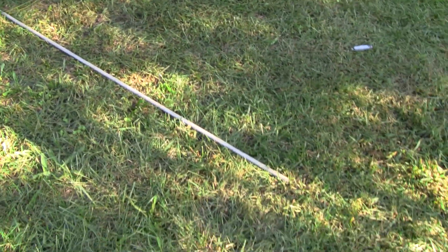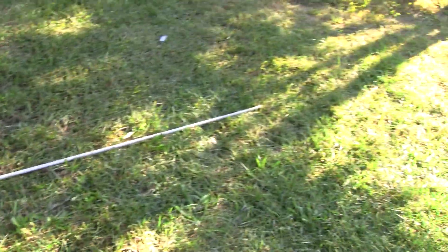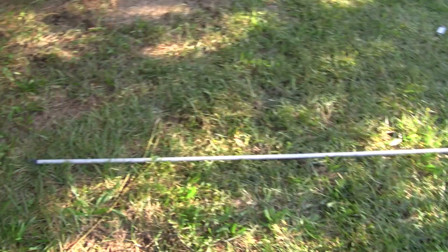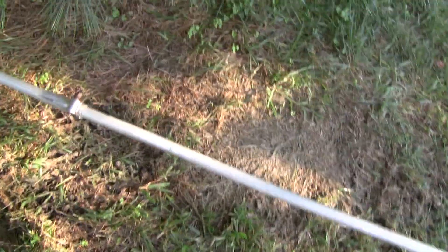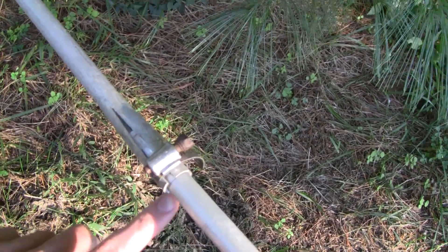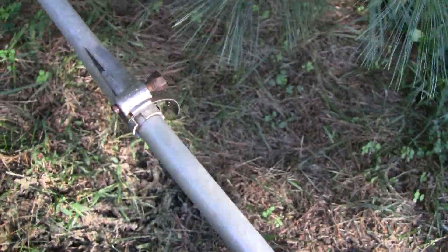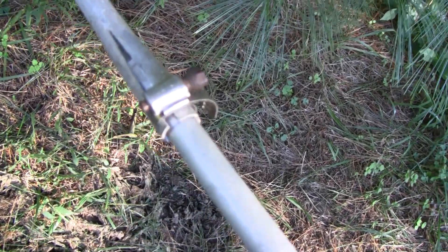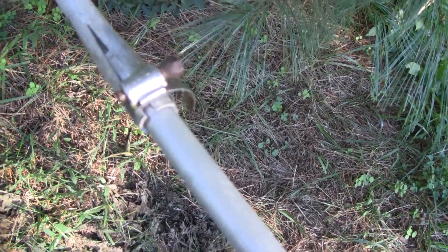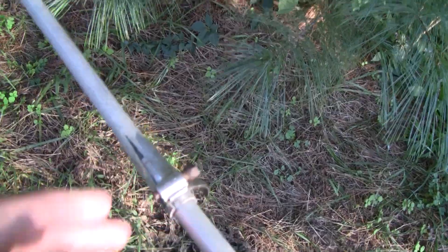The other element is half-inch aluminum tubing — I've got a spare piece here. They're about six and a half feet long to start with; I think they came from an old greenhouse. I cut this one down to about two and a half feet, then took a hacksaw and cut it down the middle — did that twice, so there are four openings. That allows it to open up so I can slide it on and tighten it with a hose clamp. The reason for that, besides making it long enough, is I can now slide it and adjust it to make it longer or shorter for tuning.